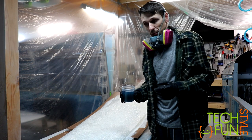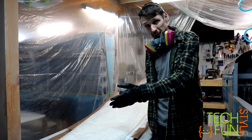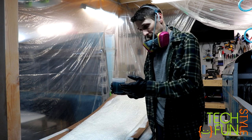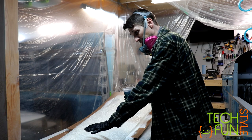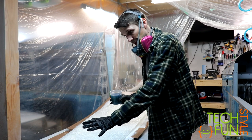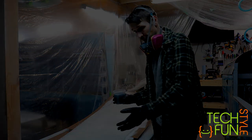So it's time now to take a mat, and my plug is ready. It's already all under gel coat. So now I'm going to be using the resin. I'm going to apply it to a mat, and by applying it to the mat, I'm going to repeat the shape of my plug. In other words, I'm planning to make a mold out of this part right now.